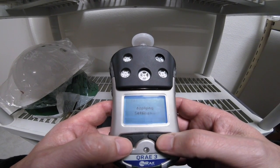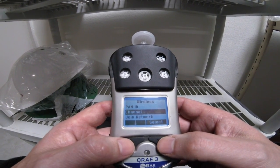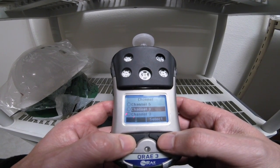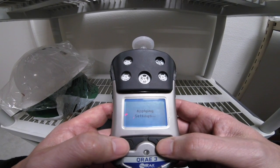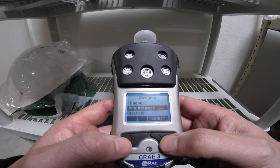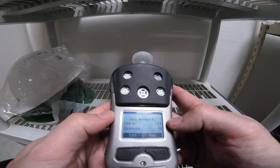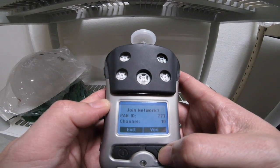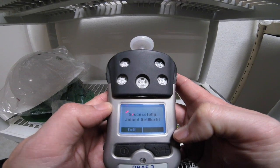Go ahead and save that — it's going to apply some settings, and it tells me that it's good. Obviously we need to check our channel as well to make sure that we're set on channel 10. We are set to channel 9, so I'm going to go ahead and change that and select it so it applies settings. Always important — you need to make sure that you go join the network to confirm it actually took. So let's select Join Network. It's saying join network with a PanID of 777 and a channel of 10. I'm going to select yes, and of course it says successfully joining network.